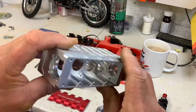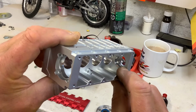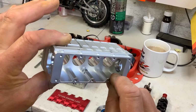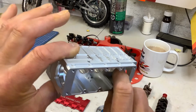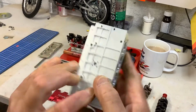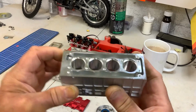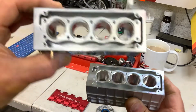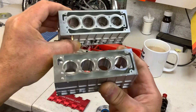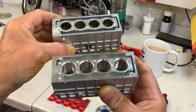And sure enough, if you can see in there, that's a bigger diameter. Toyan reckon they've tested this, the engine's okay now. I don't know what sort of testing they've actually done to it. But I don't know if you can see, there's something missing out of the engine. If you look at my other one, can you see what I haven't got in there? That's right, there's no liners in it.